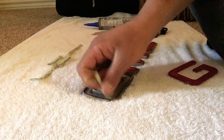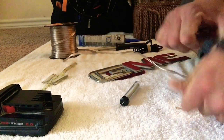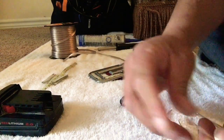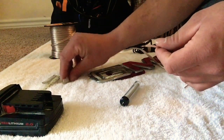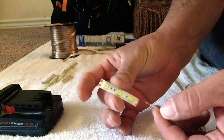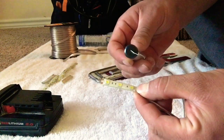Now I'll show you how to get all these LEDs to light up together. Grab some speaker wire — a smaller one, not this fat one. Cut the tip off. All the LEDs have power and ground — put power with power and ground with ground. Solder the power wire to the power and the ground wire to the ground, just like this.